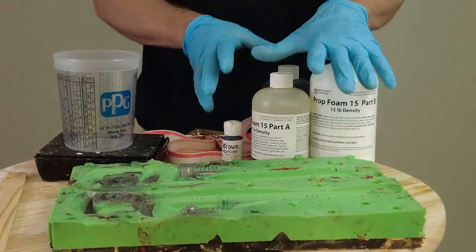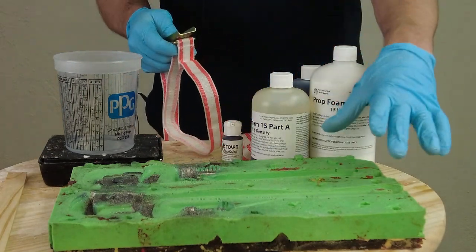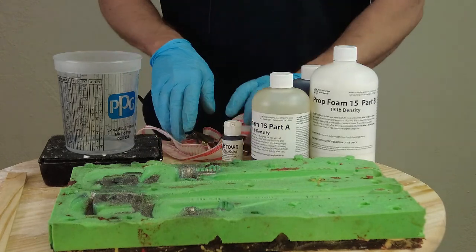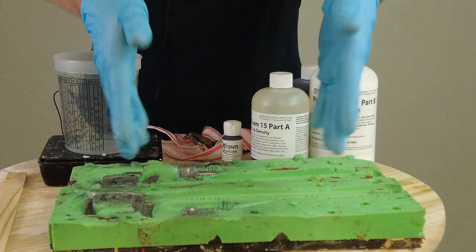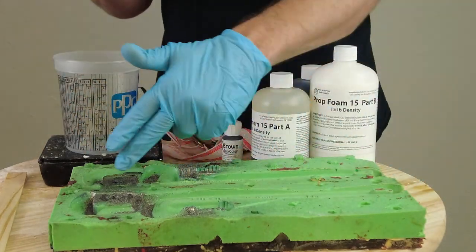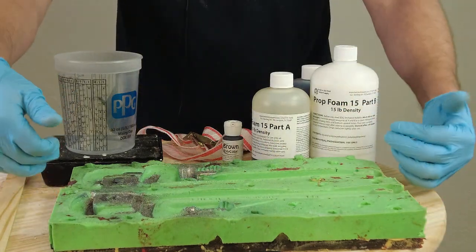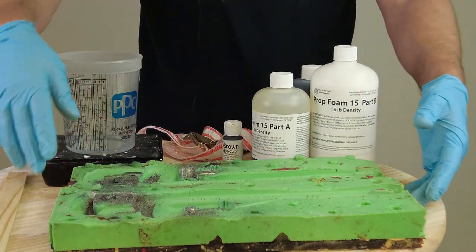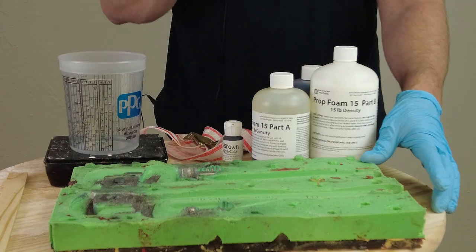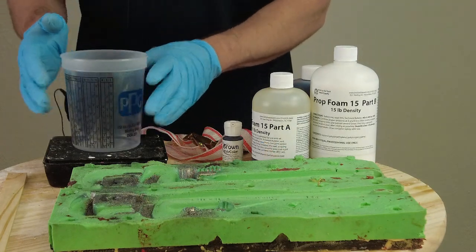In addition to having all of the components and our gram scale ready to go, we want to have our mold straps ready. We will need to immediately strap the mold shut as soon as we get our foam poured in. I have two mold straps — this is just long enough of a mold that I like to put two straps running parallel. We want to make sure we get our foam mixed up, poured into the deepest side of the mold, then flip it over, flip it back, so we get that liquid foam on both sides. Then we flip it upright once we get the straps on. It's important to have a plan of action because that foam reacts quickly. You want to have everything ready so you don't waste any time once the foam is starting to catalyze. This particular foam, the ratio is 100 parts of B to 40 parts of A — so we're going to mix up 200 grams of B to 80 grams of part A.